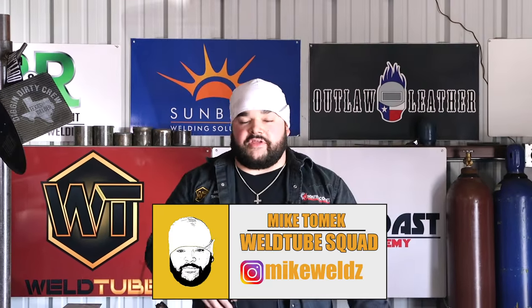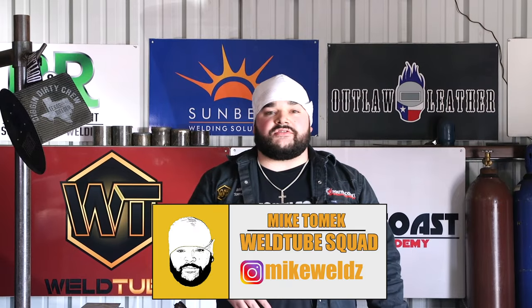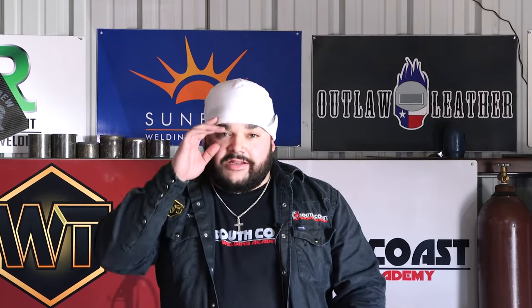In this video, requested by a high school welding instructor, it's going to be a 1G half inch plate, 6010 root, 7018 fill and cap. Now let's get to it.